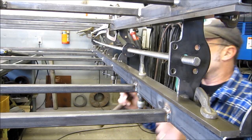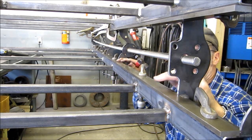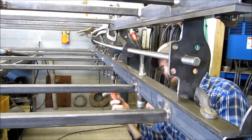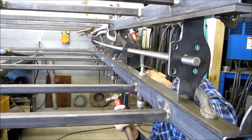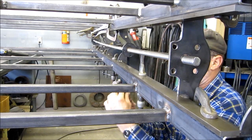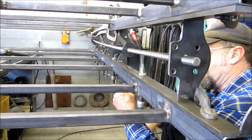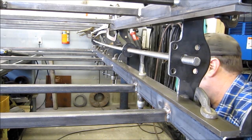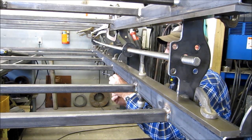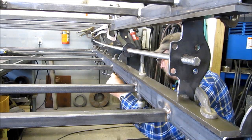The first step is clamping down the lower rail. We've gone in and closely ground and made sure that all of our walls cleared, and we set this off with the straight edge, working our way down and transfer punching each and every one of the holes. These holes are pretty snug so we'll have good alignment, and each one of these rails we're going to match mark to its location.